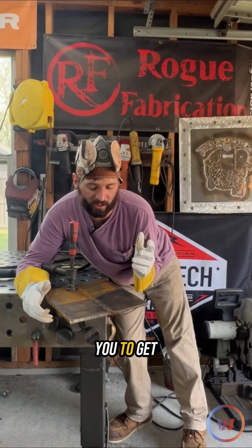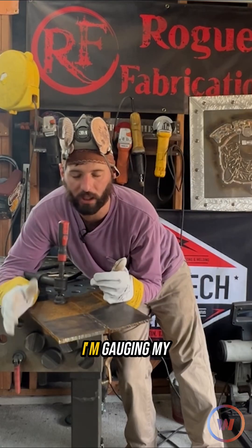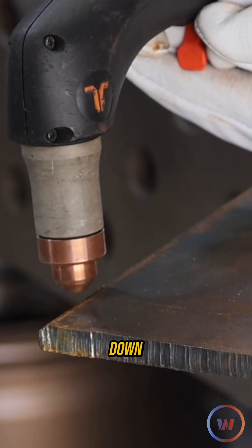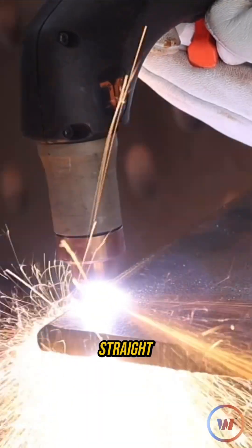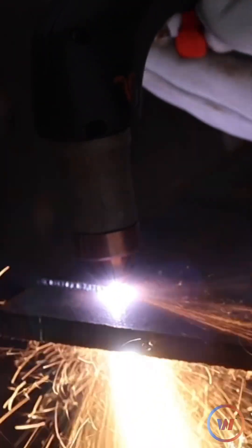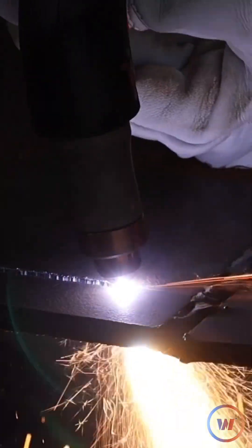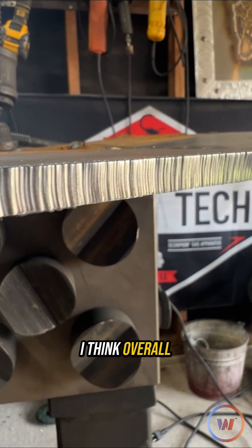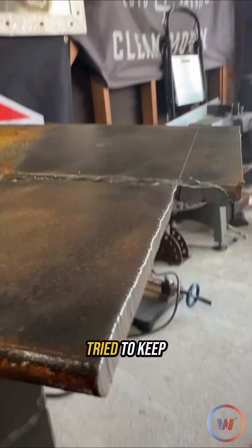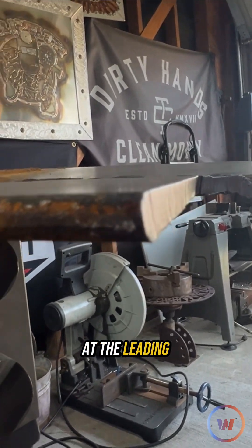The main takeaways — watching the bottom side of this cut. I'm gauging my travel speed based on what I'm looking down for and making sure it's going straight down. I'm trying to hold my torch straight because I want a square cut. I think that overall that's a pretty good cut, not too bad. There's not a lot of dross, if any. I tried to keep it as square as I could. I was looking straight down that nozzle at the leading edge of my cut.